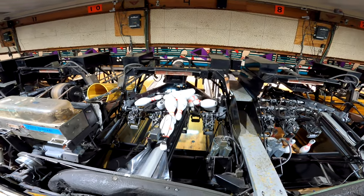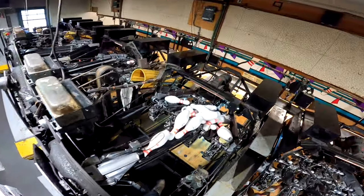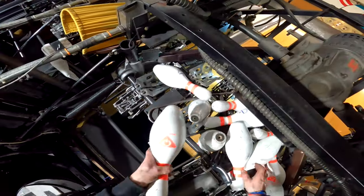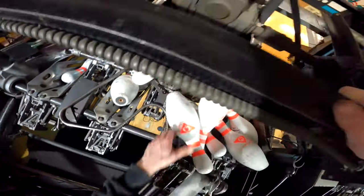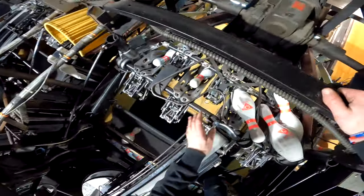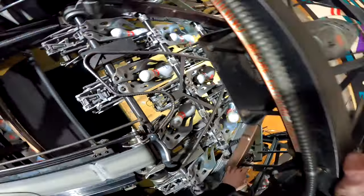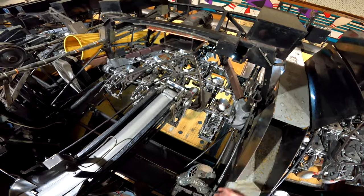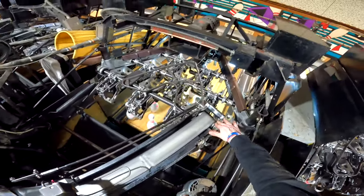On this machine there is a terrible pin pile-up on top of the table. This one is fairly straightforward — clear the pins that are on top, and if any pins are missing from the spotting table, just put pins in the cups. If after clearing the jam you're still missing pins from the table, grab one from the pit, throw it in, and once you have all 10 pins, position the distributor on the 7-pin side and it will set the pins.